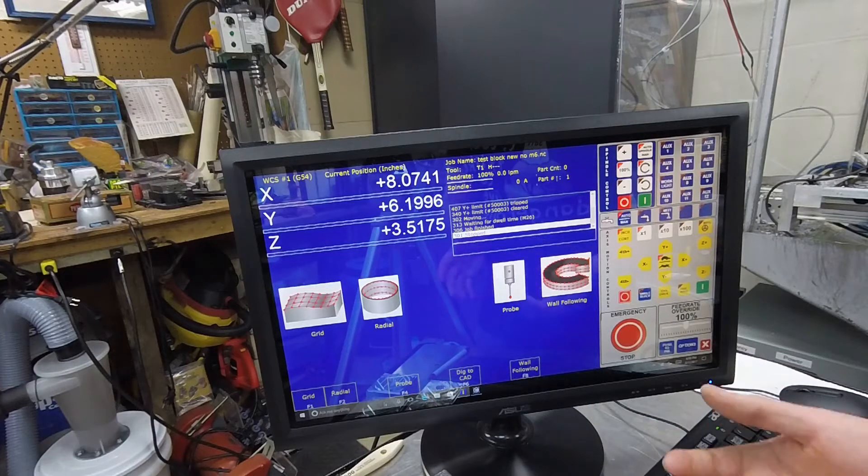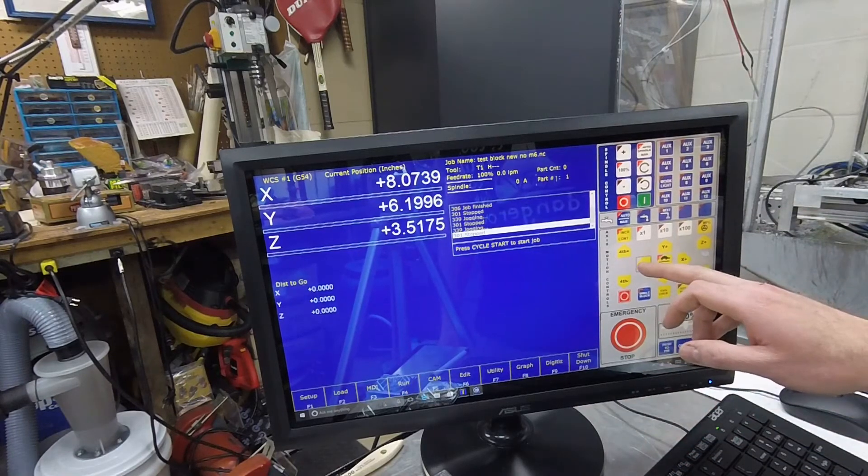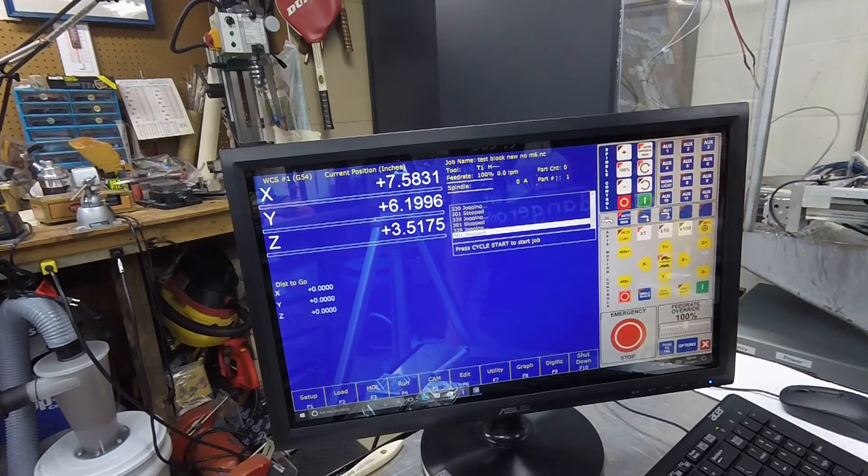You can even digitize — put a part in the machine, the probe goes around it, and it can tell you in relation where everything is. You can use it to immediately copy another part on the machine, or send it to CAD and adjust the part however needed. Everything's touch — you can move the machine just by touching, move all your feeds, control your spindle, set up auxiliary buttons. It basically does everything you would need, with no different little macros needed for probing, parts setup, or adjusting your CAM post processor. It's the most user-friendly software I've ever had, tenfold better than Mach 3. You can also do backlash compensation, ball screw mapping, and get your machine just right on the money. It works flawlessly.